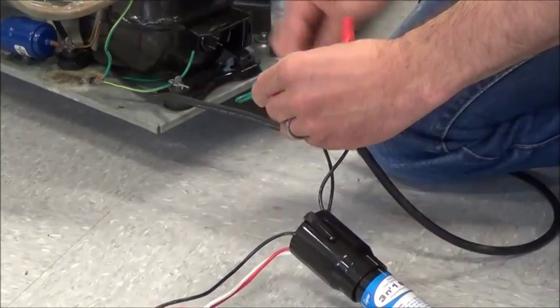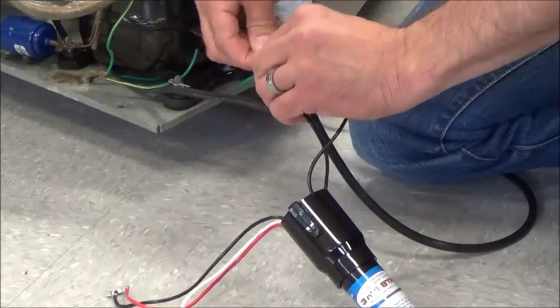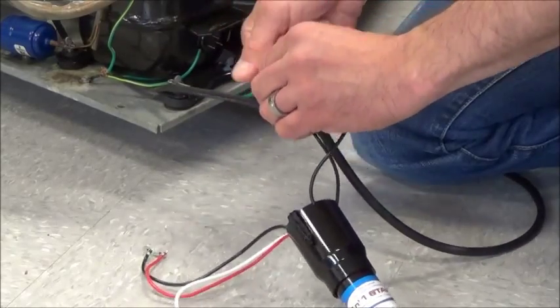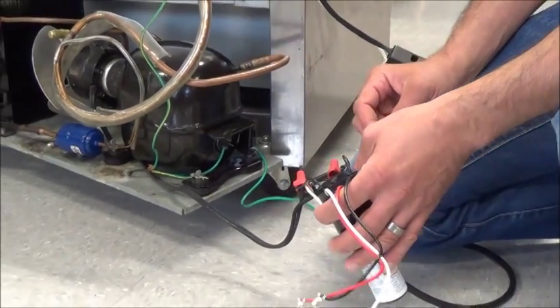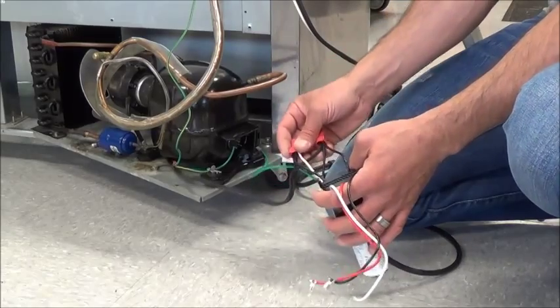Since it's 115 volts, we know that 115 volts gets there by two wires — a neutral and a hot, which they sometimes refer to as L1. So if you look at it, that's my incoming voltage going to the unit. This voltage is what starts the compressor, and this compressor is started by the thermostat that closes and sends 115 volts there.